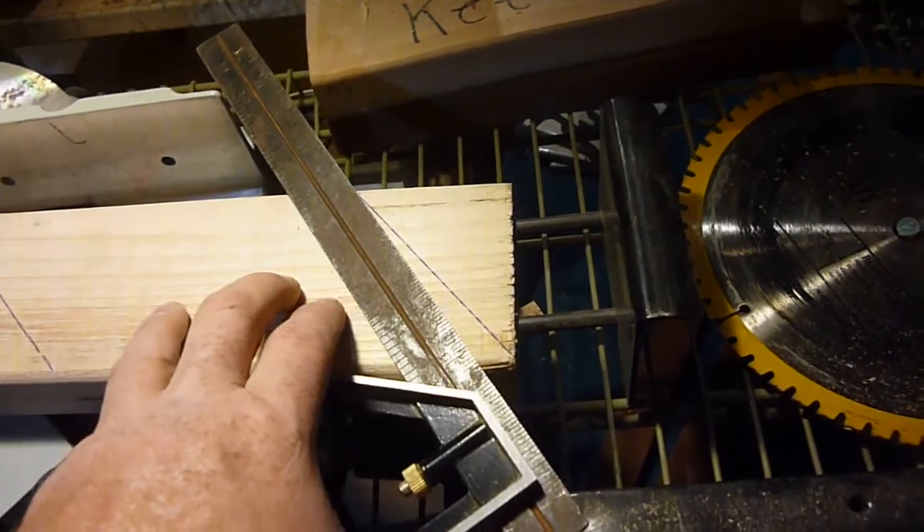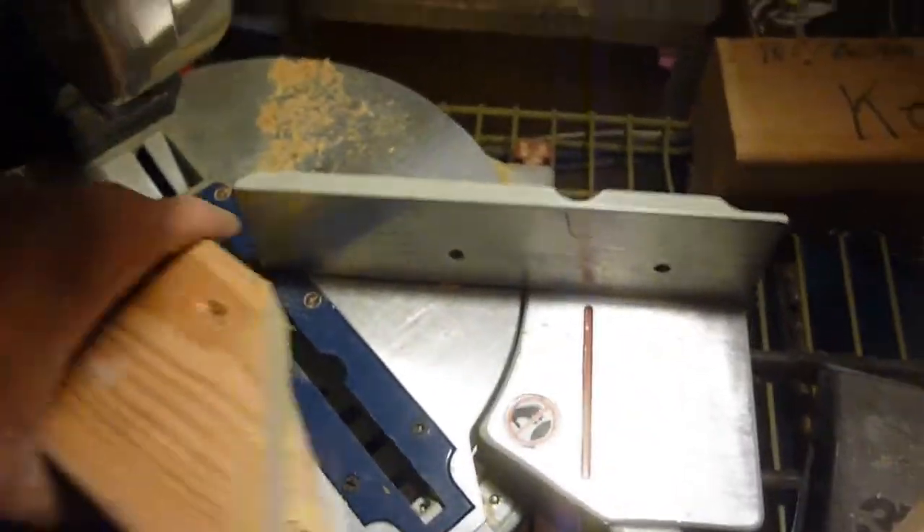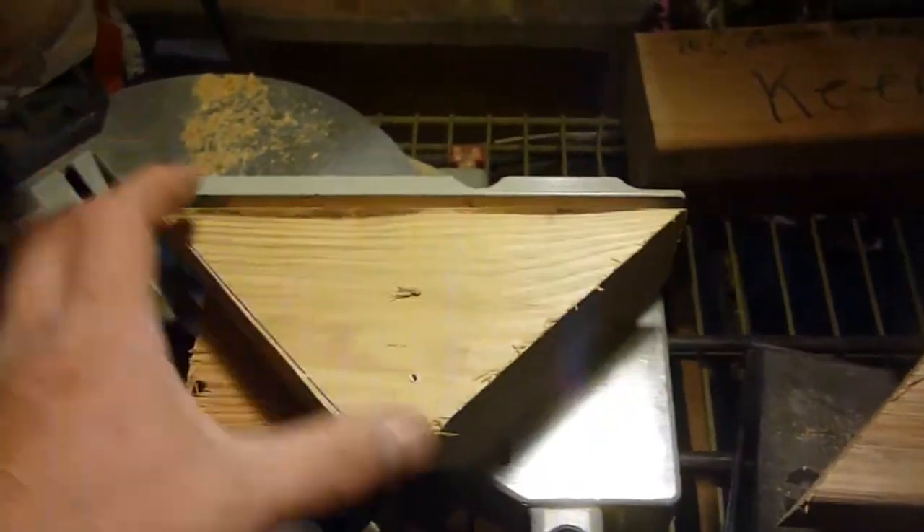I used the best 2x4s I had for the outside ones. Let it set so it does the 45, put it on there, mark it, take the chop saw, cut it right at 45. I got a couple long ones and several short ones. I put the marking piece on, used the same piece to mark each time, marked it and then cut it — that way you don't have to move the piece back and forth. Most people know that, just a little tip.